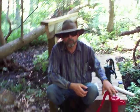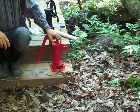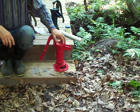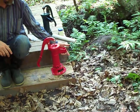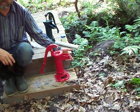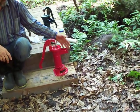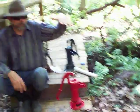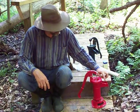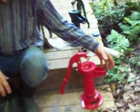Some people may want to put an electric pump on — I don't have information for that — but I do know about hand pumps. So I'm going to show you this one here. This is called a pitcher pump. A lot of people have these out in their gardens; these were never designed to be put in a garden, although if you put it there it will work. The pump is very low, so if you mount it directly to the ground, you'll never be able to get a bucket of any significant size underneath it to catch the water. So it wouldn't be very appropriate in that configuration. But you can do as I'm fixing to do — build a little platform off the ground and mount the pump up there. If you have a bucket that you want to fill, a lot of these pumps are designed with a little groove to hold a bucket handle so that you don't have to spill a bunch of water. Just hang your bucket there and fill it up.